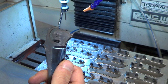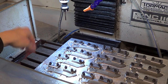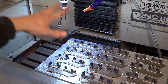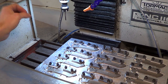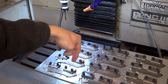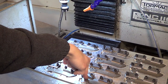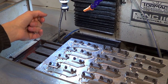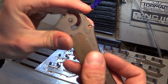This should press out pretty easily but I don't know if the hole will clean up very well. So a long overhang on the reamer is actually not a good idea. I'm just going to have to live with the possibility that it might ream the hole off center — but I don't know if that's even a real possibility. My fixturing is pretty accurate so it's more of a theoretical thing. If I was really anal I could use my digital probe and probe the center location of every single hole and then ream exactly on that location — that would be the most accurate way — but just food for thought. It's kind of sucky to blow up a carbide reamer, and I have a blade that might be borked.